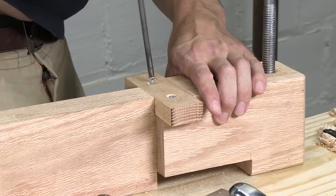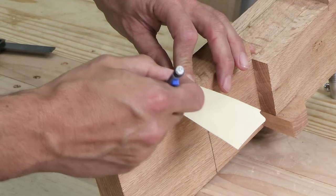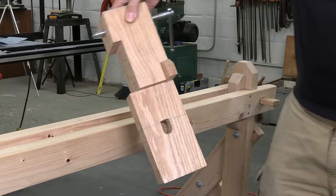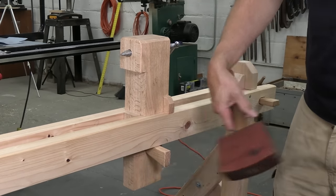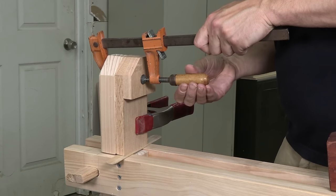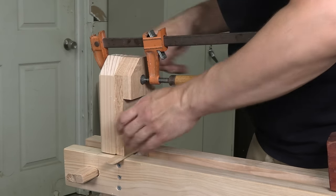I add a little cross piece to the back, and my poppet drops right into my bed. I can use the same angle template to mark out a mortise, then drill it out and make my wedge. Now I've got a fully adjustable poppet that I can move anywhere I want and lock in place with a few mallet taps. My second poppet is fixed in place — it's just part of the left-hand leg assembly. I designed it this way so there are fewer parts to make, but I think I regret this decision.